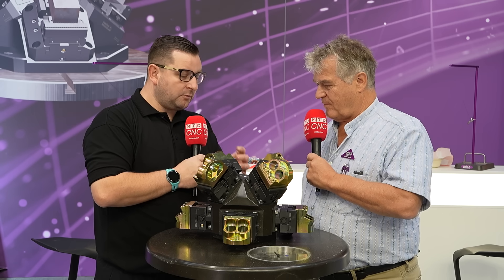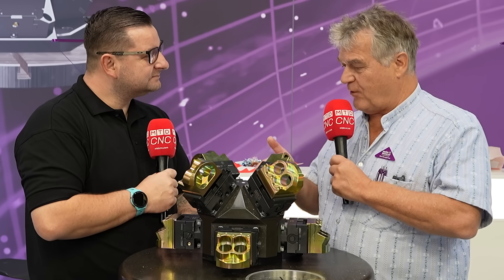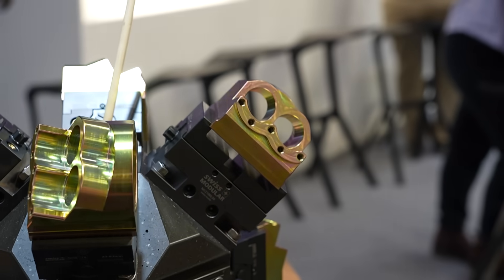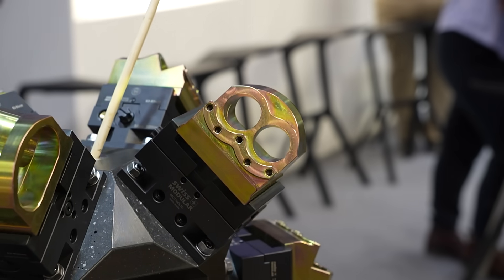So Beert, can you tell us about what we have standing behind us here, because this looks brilliant. Yeah, thank you. It's something really new — we just produced it for EMO. The Space Grip itself we've been doing for many years, there are different sizes, but this particular one is made from epoxy. The epoxy gives you the advantage of killing vibration — its dampening effect is very good; compared to aluminum, for example, it's 100 times better.